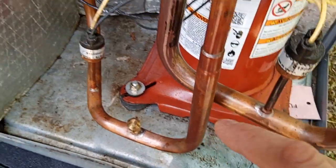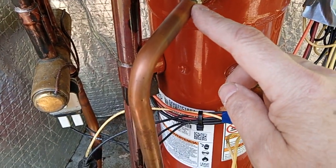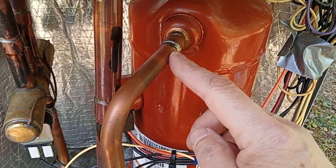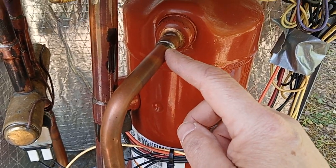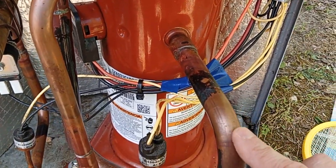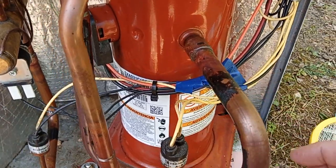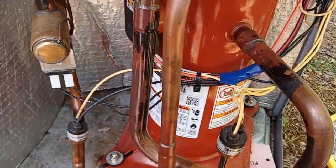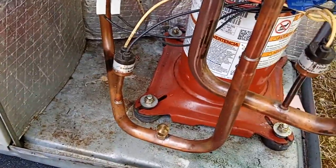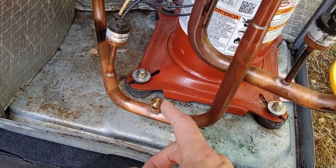assembly. The high side is universally the small line because smaller tubing has a smaller surface area inside and can withstand higher force inside for less pressure. Pressure is force over area. The low side line should be the larger line, maybe returning vapor, larger line, better flow for vapor, but can't take as much pressure. And that's a universal thing in mechanical engineering. It's called PV.